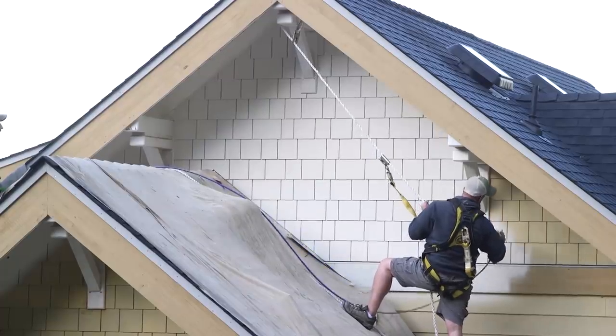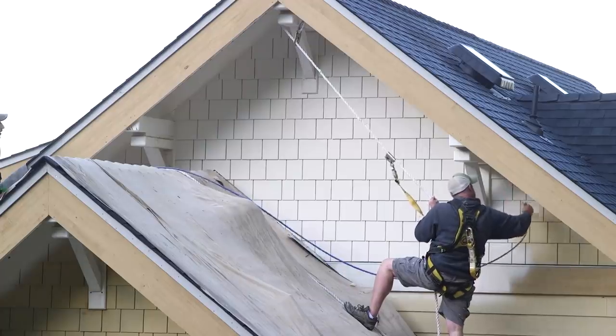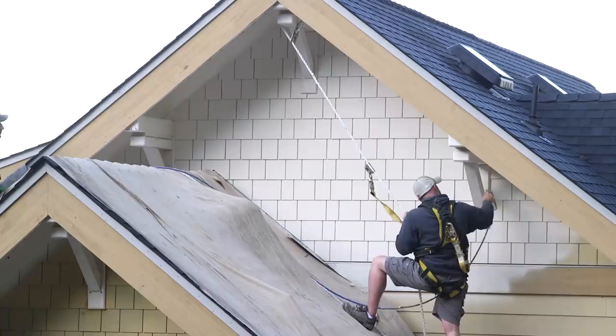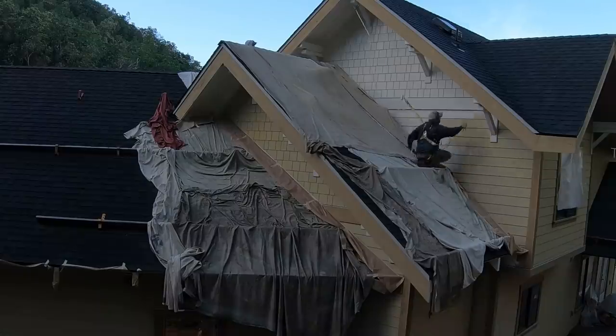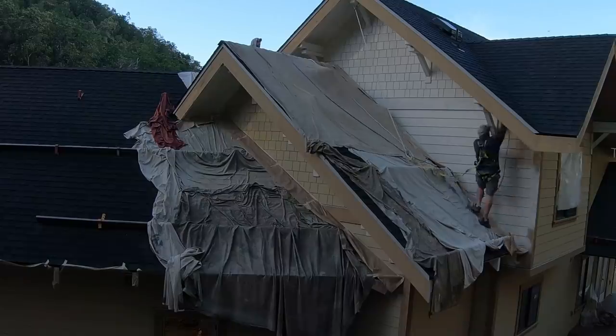So a total coverage of about 10 inches is what you can expect when you're about a foot away from the surface. The 15 describes the diameter of the orifice. It means the diameter is 15 thousandths of an inch. That's not very big.